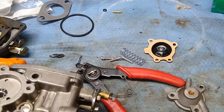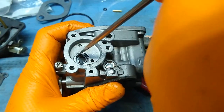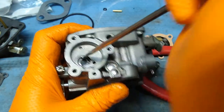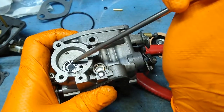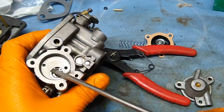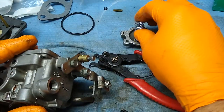It doesn't just balance — it kind of goes around, but you make sure it's seated. Once you get it into the snap ring groove — it just went in when I pushed on it with the screwdriver — you can see by the ends of the snap ring that it's in the groove. That part's done, and the spring actually goes on the cover.